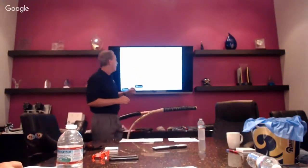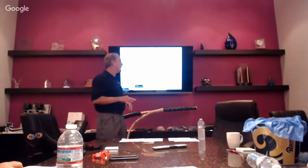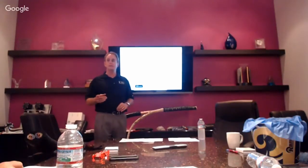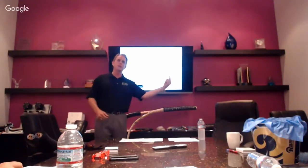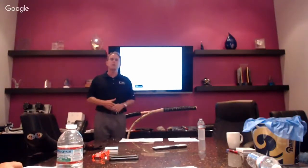For example, 6-inch conduit for 9 lines or less. 8-inch conduit for 10 lines to 12 lines. So the question is, can you get a 12-line bundle through a 6-inch conduit? A lot of times, yeah. If they put it in to spec, which is one 24-inch radius sweep going down and one 24-inch radius sweep going up, and you've got 100 feet in between, we can pull a 12 line through that.